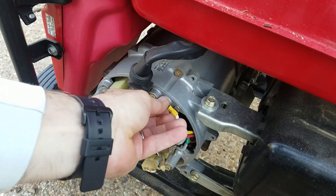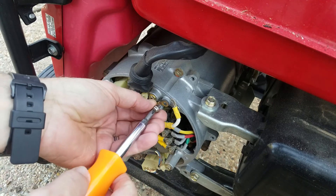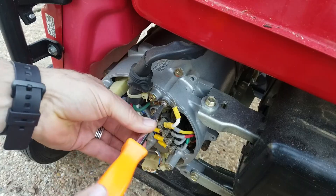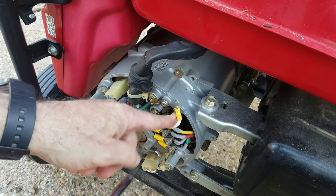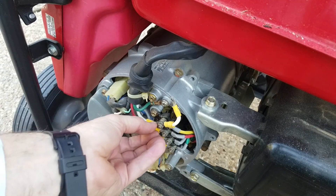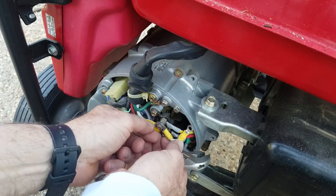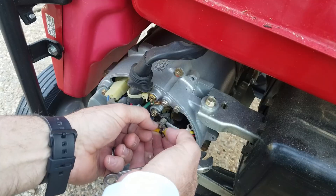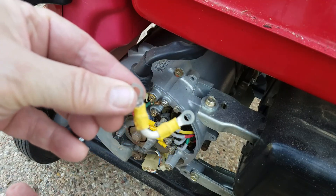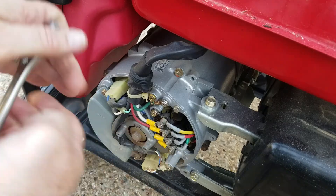Take this screw out, take that off, put that ground wire back in, and then take the bottom one off. We'll need a little wrench to do that. Got a nut and a lock washer on there — pull that jumper off. Save that little guy if you want to use this outside with tools, rather than for power generating the house.